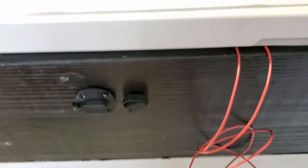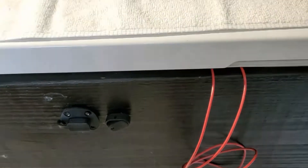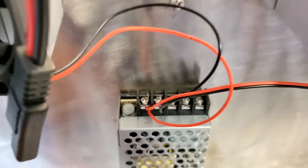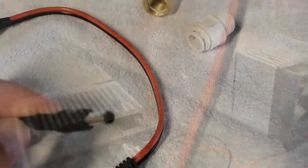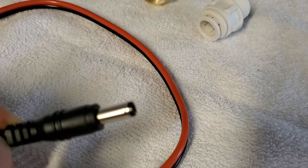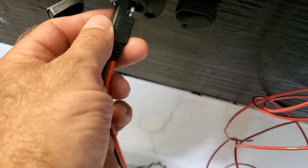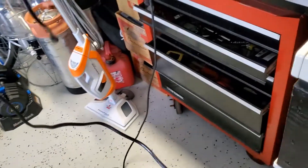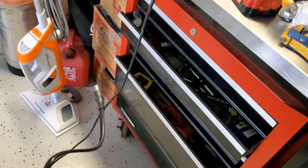Let's get started. I've put a switch for the fan here — I just haven't tightened it down. That switch will turn power on to the fan system, which is a 110 volts AC to 5 volts DC converter to power these fans. This connects to the FTSS controller, which has a 12 volt output to the pump sitting in here. I made a connector so I can quickly plug it in and have enough length to set the conical anywhere up here once it's all cleaned up.